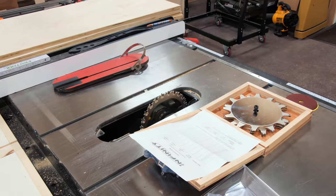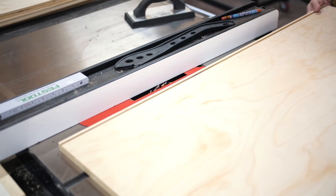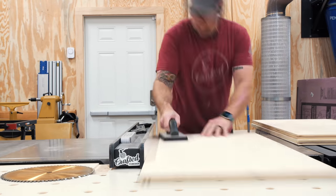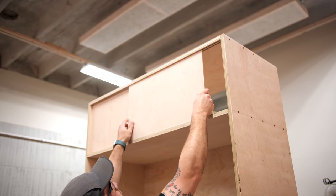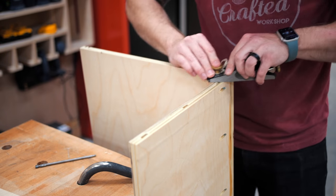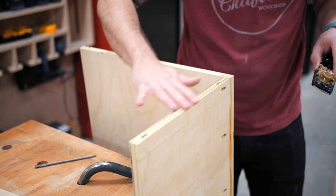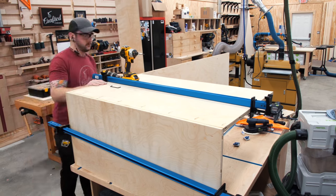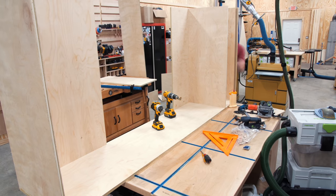The one big change to this Murphy bed cabinet versus my last build was adding an upper storage section enclosed by a pair of sliding doors. To accommodate them, I cut a pair of quarter-inch wide grooves into the bottom face of the top panel and the top face of the divider — quarter-inch deep on the bottom set and half-inch deep on the upper set — so the doors can be lifted in and dropped into the grooves. Assembly was a little tricky due to the sheer size of the cabinets, but clamps helped. I ended up screwing the sides on through the face since five of the six sides won't be visible in the finished installation.